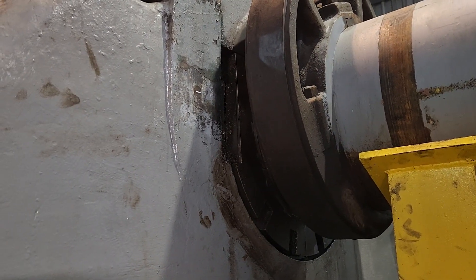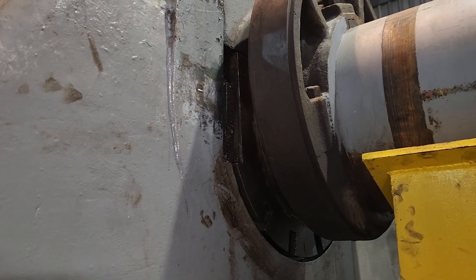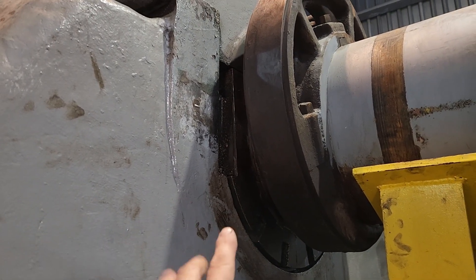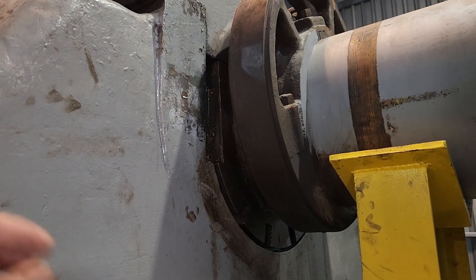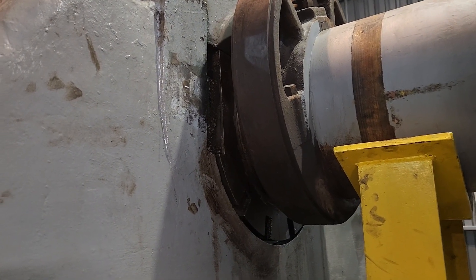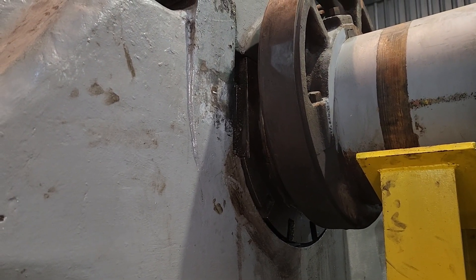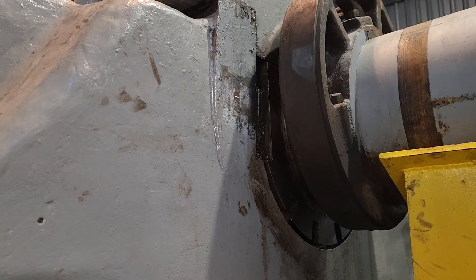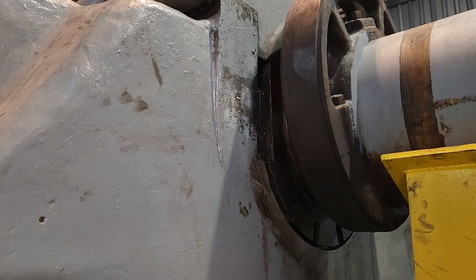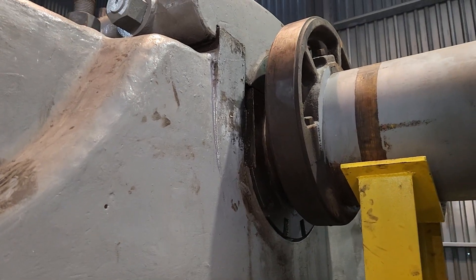You can bring it in till it's just about snug. If you're running the engine and getting a little bit of pounding, it could be that the bearings are loose, so you tighten them up. If you tighten them up too much, the bearing will start to warm up. You want to get adjusted to the point where it's not pounding, there's no visible back-and-forth movement, and it's not heating itself up.